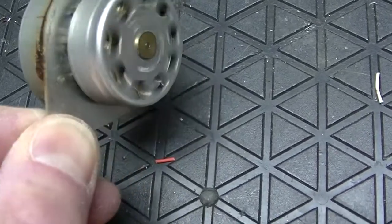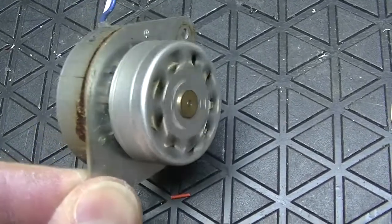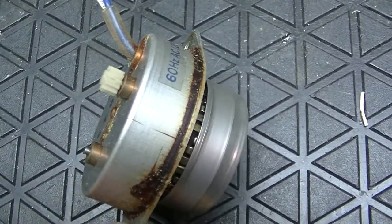Here we have the switches from the original set in the new clock unit — it's almost like they're conjoined twins. The next step will be to get the motor on. Don't forget to use the lock washers on the screws, and the spacing washers that keep the switches exactly where they're supposed to be.